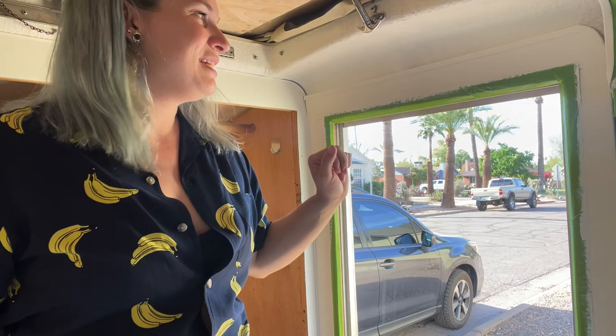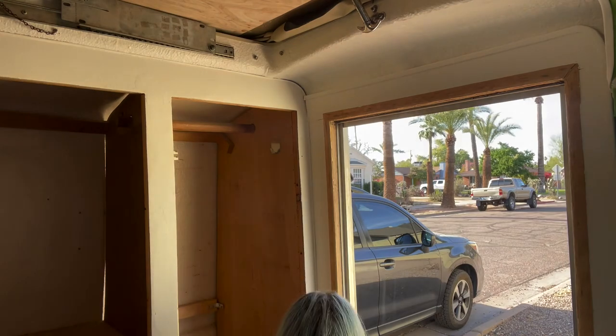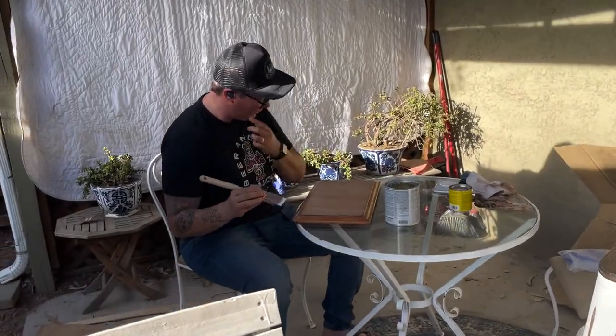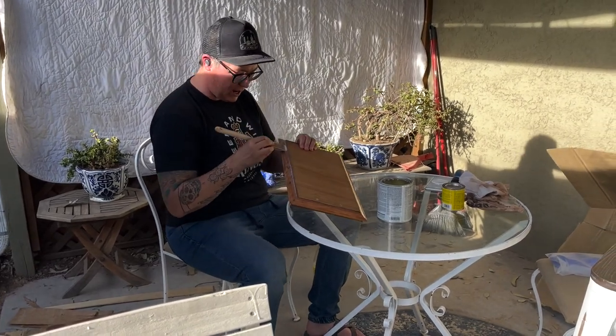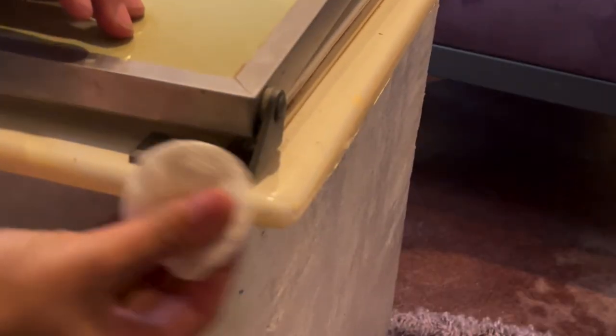While Erica is polyurethaning and sealing all of the drawers and cabinets, it's time to take off the tape so that we can stain the little wood finishes around the camper. Next, we want to get the paint that is on the icebox on the outside — the last time somebody painted they didn't take it out, so there's a little bit of that apricot paint around the border and we want to remove it. It's on plastic, so we can't use paint thinners, and if we sand it, it gets gritty and gross. So here's a solution: nail polish remover. Make sure you get the kind with acetone — that's what you need to get this paint off. It's coming off, it's really slow, but it is coming off.